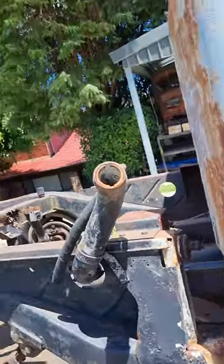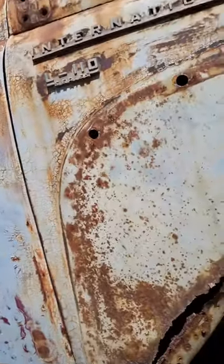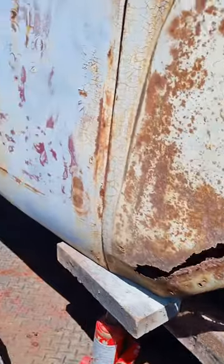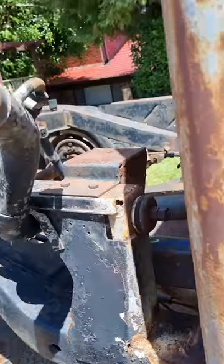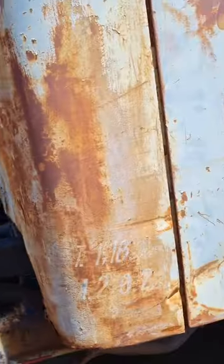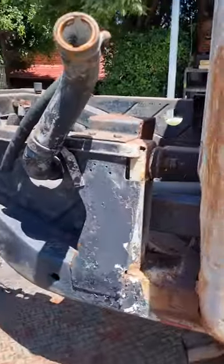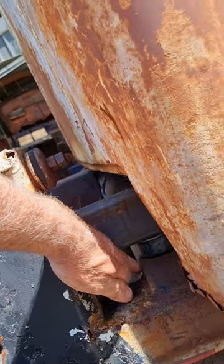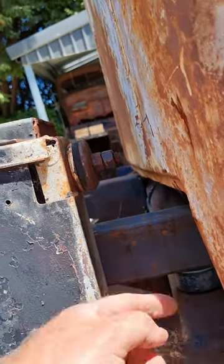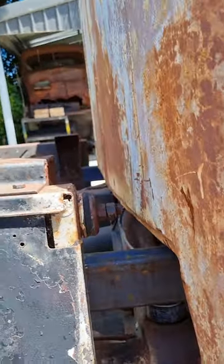I've popped the other one in place somewhat. Again, I cut this at 1553 mil. The ironic thing is, if it was 3 mil shorter, it would fit nicely, but it's not. So what I'm going to do is, I actually had it lined up in the front here, the bolts in the holes, and I just squared a mark up. I'm just going to choose this point here, then the cross member, just come up there, just got to cut this there, and it doesn't need to be longer than that. It's got a good footing on the mount.